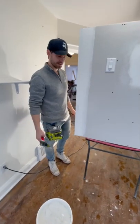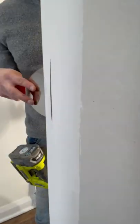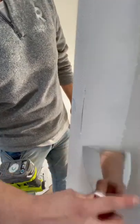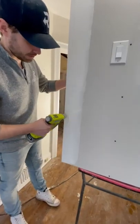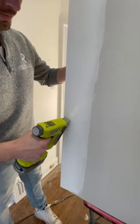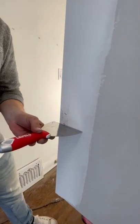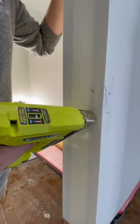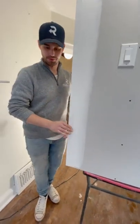Let's try our hand at fixing the vinyl first, shall we? The vinyl bead kind of puckered out where it got smashed. Just make sure there's nothing back there, no hard bits — I'm just going to scrape that out. I'll take a stapler, and all I'm going to do is staple this back in place, making sure that those are self-flush. Now, the vinyl's been reset with a mechanical fastener.